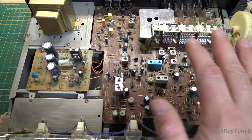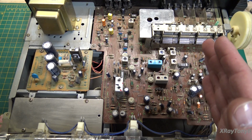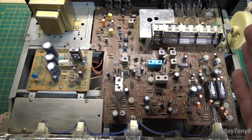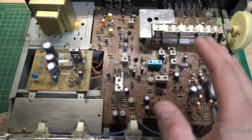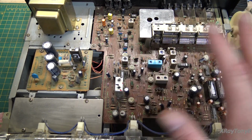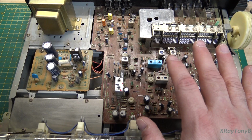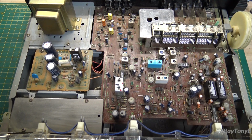But again, we talked about if your FM alignment is not set properly, if you get out of phase with your 19 kilohertz, your 38 kilohertz, being on center with your 10.7 megahertz IF, any one of those things will throw you off frequency, and it will radically affect the sensitivity and the ability of the tuner to lock onto a stereo multiplex signal and all kinds of things.